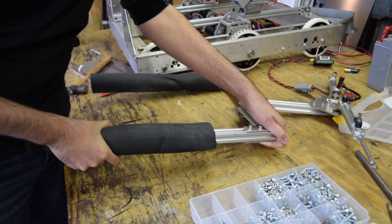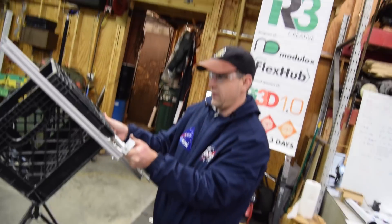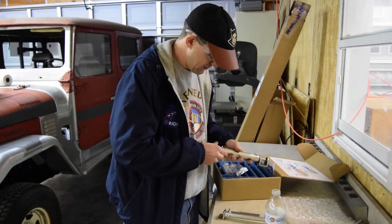We've also added foam to improve the design. Some cons of a claw like this: it takes up a big envelope when the pneumatics are open. It only has two positions — open and closed — and when open it could extend outside our frame perimeter, so we need to make sure it's designed to sit inside the robot at the start of the match. One good thing is we already have an air compressor on the robot since we're using a shifting transmission. If we didn't already have pneumatics, we wouldn't add a compressor and tanks just for this gripper. But since we're already using pneumatics, this actually simplifies things — we get a full extra claw mechanism without adding any extra motors.